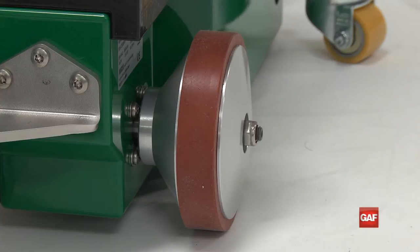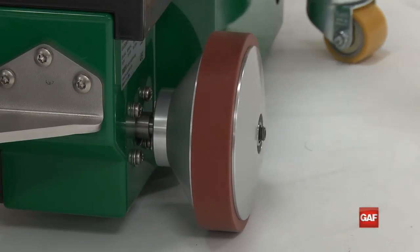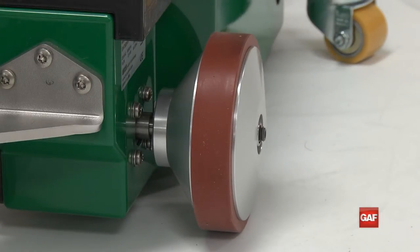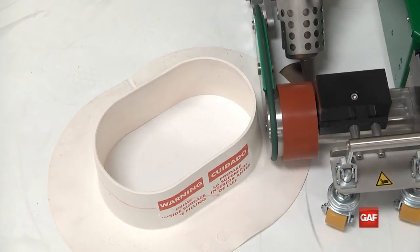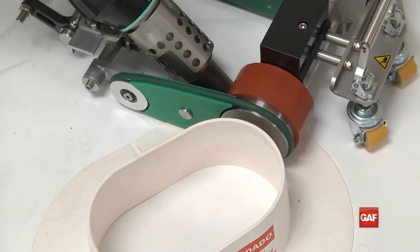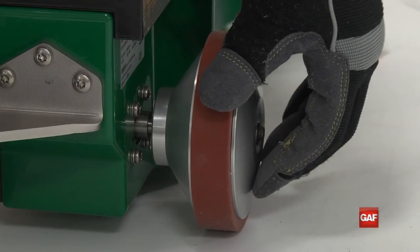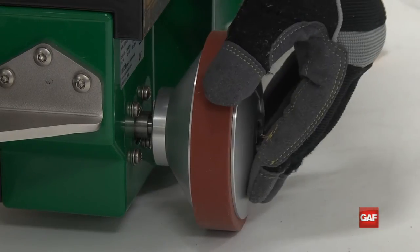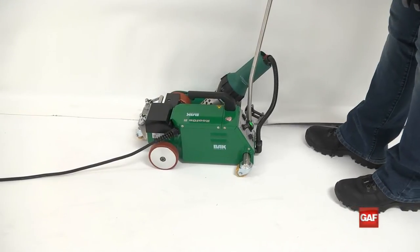The narrower drive wheel on the Roof on Edge can be adjusted to weld on curves for special roofing accessories by pulling the wheel away from the body of the welder until you hear a click. Because of its unique pressure wheel design, the Roof on Edge can weld in even tighter circumferences than the regular Roof on welder, making it very beneficial on certain single-ply roofing accessories that currently require hand welding. To return to the straight linear welding path, simply press in toward the machine while turning the wheel until you hear two clicks. The wheel will then be locked into a straight-line welding position.